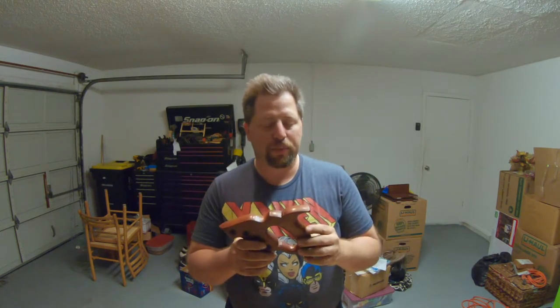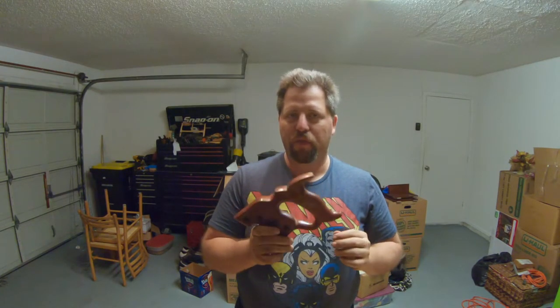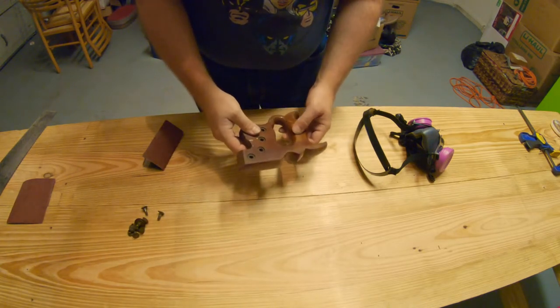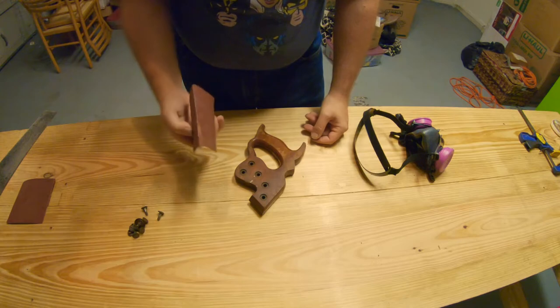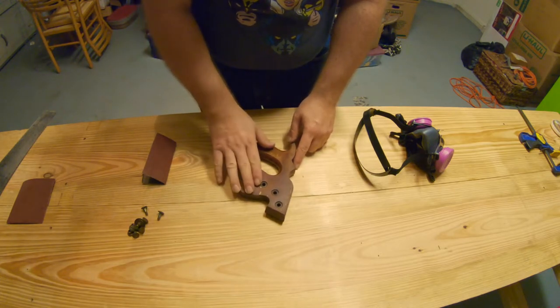Sometimes you'll find handles where they're just broken to pieces, been abused, the horns are chewed up, and it's up to you whether you want to try and fix it or just make an entirely new one. You can find patterns for handles online, but my recommendation when you're first starting out is to find one that's not too badly damaged and just refinish it. What we're going to do is start by sanding through whatever lacquer or shellac is on here down to the clean wood. You can use sandpaper, rasps, card scraper, whatever you have.